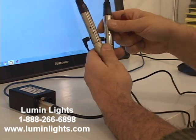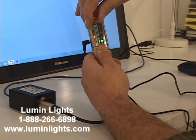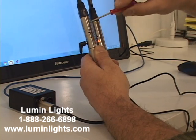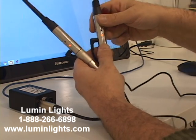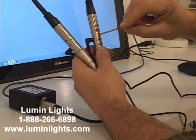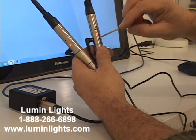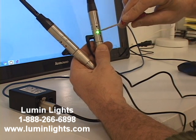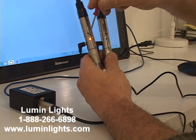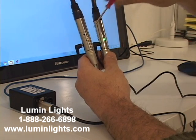To solve this problem so he doesn't mess up your light show, you can come in here and change your color from red to green — two presses. Now I'm on green, blinking red because I'm transmitting but I am on the green channel. My receiver has stopped blinking green because it's no longer receiving on green — it's steady red, waiting. We need to change this unit also to green, and there it goes, flashing green, meaning it is now receiving the signal again. Your transmitter and receiver need to be on the same color, and each color represents a frequency so they can talk to each other.